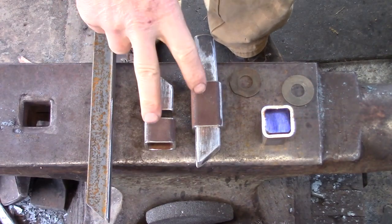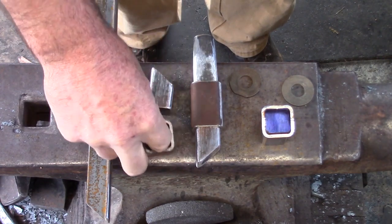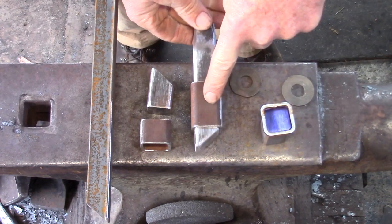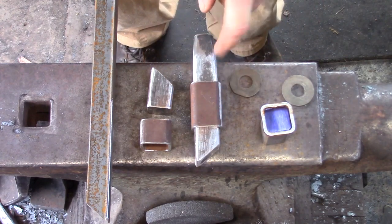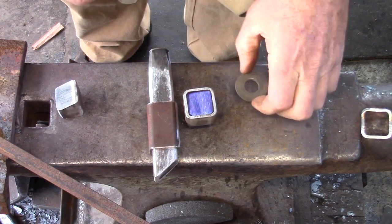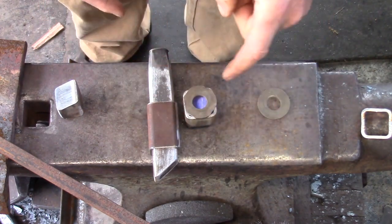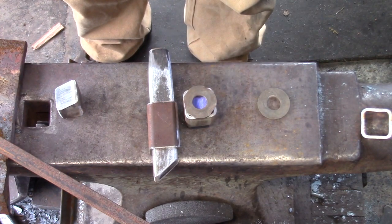Here's a simple guillotine. I've taken an inch and a quarter square tubing with 120 thou wall, and I've removed the little weld down the seam so that my inch has about 5 thou clearance. This is inch square mild steel and that will slide up and down in the tubing. On the bottom of my tool I've taken a normal round washer, knocked some of the corners off so it fits — I can catch those corners with a bit of weld, and the round bit allows me to knock out that die if it ever gets stuck.